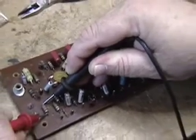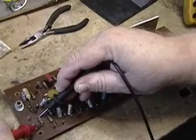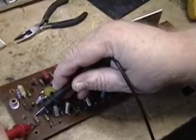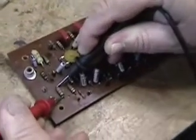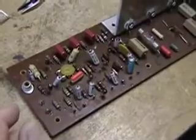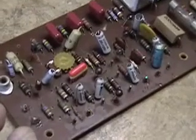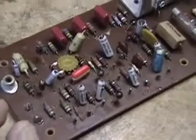This one here is supposed to be 68k — it can't be any more than about 7k above that, so 75k would be borderline. It should be much closer to 68k. The first stage won't operate properly, and if it does, you will not only get more distortion but the output level will be lower.